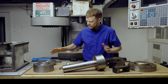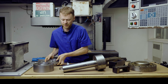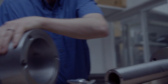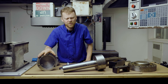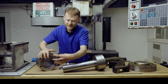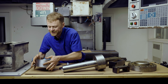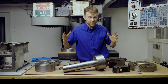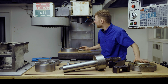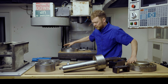The other thing to mention is that this adapter has a cutout for the draw tube, and this A26 also has a cutout for the draw tube. It can be a pain to pull a draw tube when you're doing an alignment, so you just clamp the turret and make sure the draw tube is in — this will fit over it. If you're using the A211 big spindle with a big draw tube, you've got to use a spacer or pull the draw tube. So this is a ground spacer that you then bolt the ground plate adapter to.